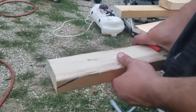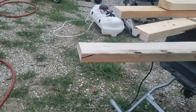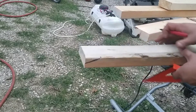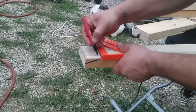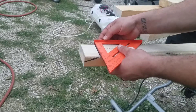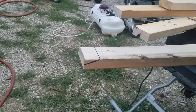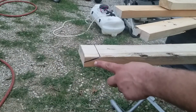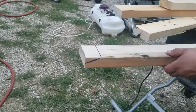Let's see if I can drill this and get close. I had to go get my square. About where this thing crests in that area, make a mark over, and then about three quarters of an inch — I'll come back again and do something real similar right there. That'll give me an idea of what I'm doing. These boards aren't going to be seen, but they're in a position where I can't access there and this needs to remain flat, so I have no choice but to drill that way.